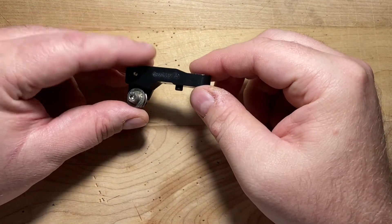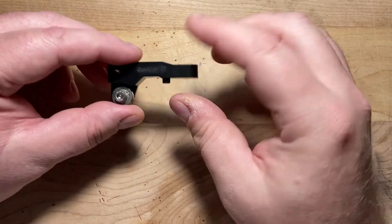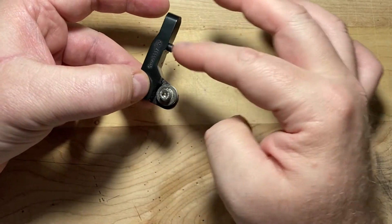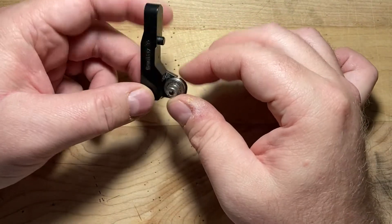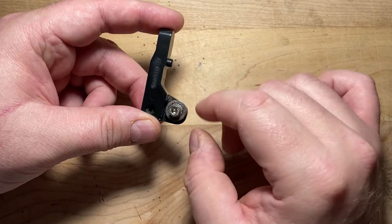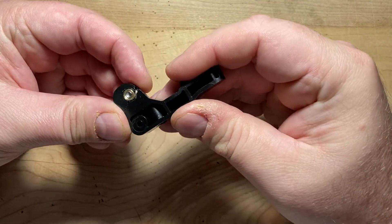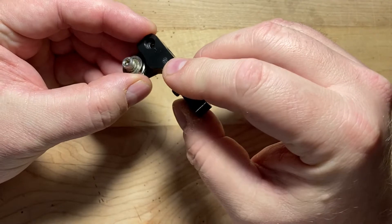I've got an Ender 3 made by Creality. What I found was this — this is the tension arm on the extruder motor setup. You have the little drive gear right here and it pivots on this. There's a spring here that pushes back so that this little idler pulley actually puts tension on the filament, so that as the extruder motor turns, it pushes it into the hot end. From the top down, the way you'd see it on the machine, you can't notice any problem at all. But when I took this off, I noticed a great big crack that completely negates any tension you might be putting on the filament with this pulley.